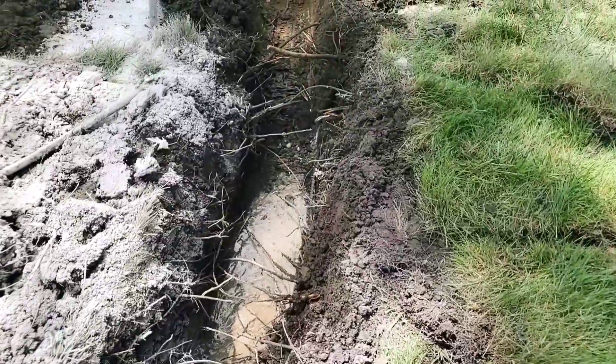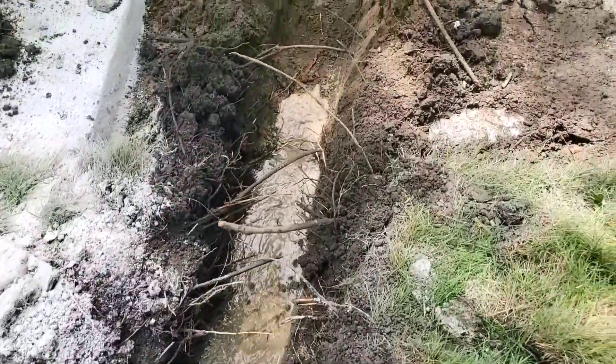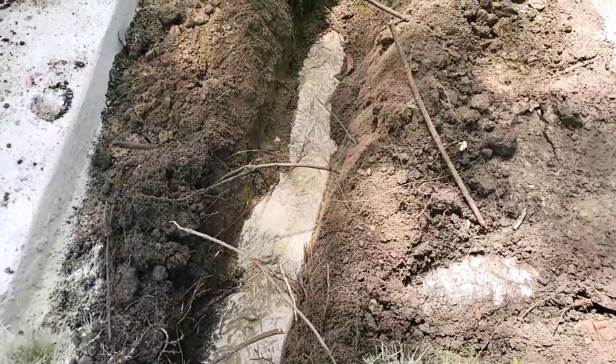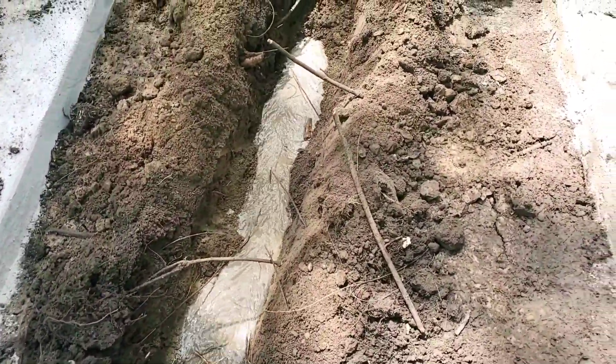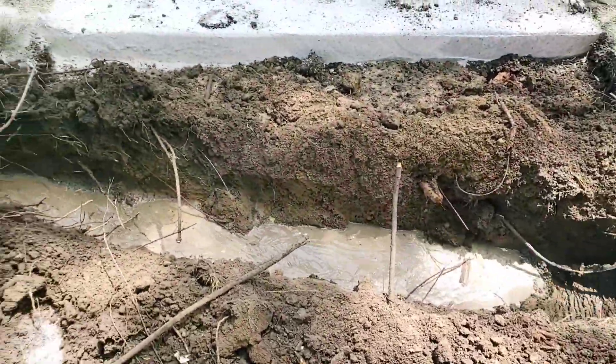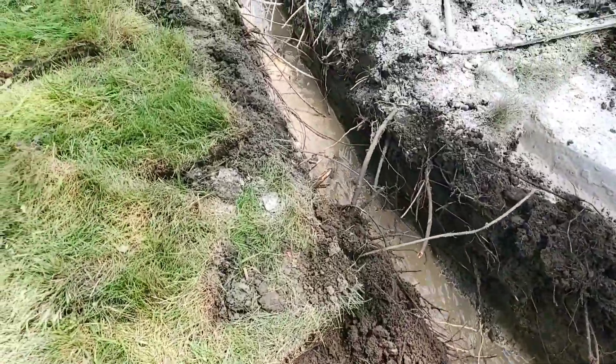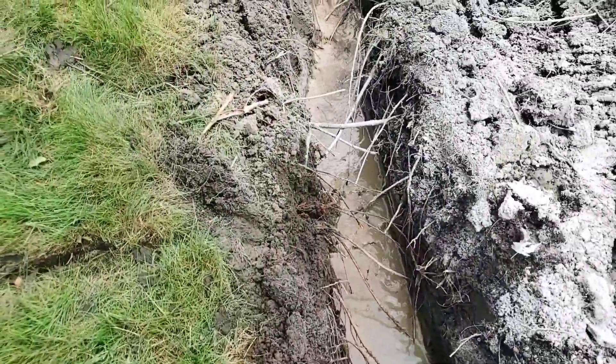If it's there, guys, take it. I always say take as much slope as you can. If the lot lends itself to 4% or 5% slope, grab it — why not? So we were able to run 4% slope to chase this water that was all dammed up in the backyard out to the front street.